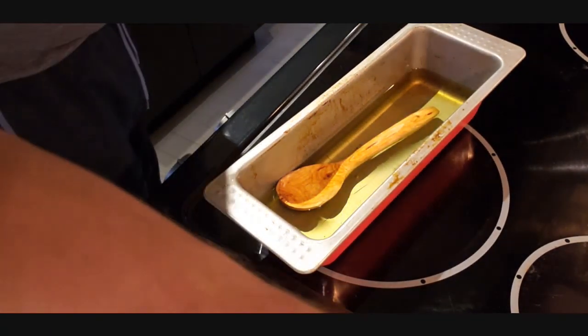And after boiling, you don't need to keep it in the Ziploc. When it gets hot enough that you can see bubbles coming out of your spoon, that's when you turn down your heat to 50%. Sometimes I do even 30. All we need to achieve is to keep it bubbling without getting overheated. Because if it gets dark outside, it starts literally burning. The wood is gonna be destroyed by the oil, and that's not what we want. We want to make sure that all the moisture gets heated right through and evaporated and displaced with the oil.